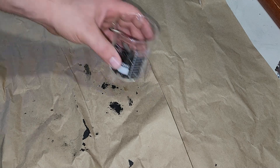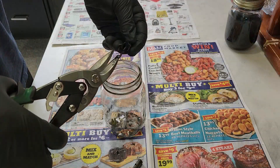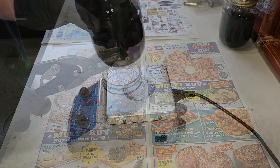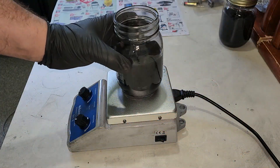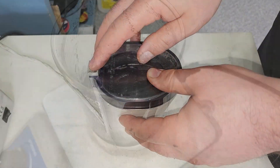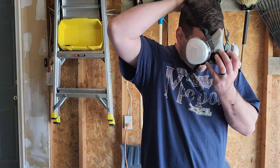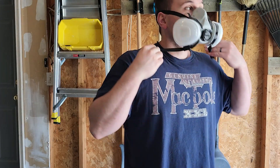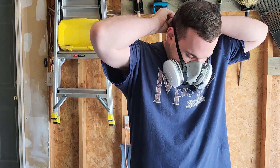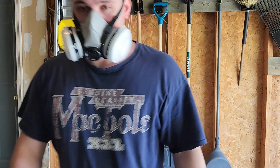It's worth mentioning the ABS juice I'm using is mixed at a ratio of 4 g ABS plastic to 10 ml acetone. The manganese dioxide powder was prepared by breaking down dead dry cell batteries, putting the black powder portion in water, stirring to break down the larger clumps, decanting the mixture after it had settled, and then grinding into powder when dry. A note about safety: because toluene and acetone are very volatile organic compounds, all this work was done while wearing a respirator equipped to handle organic fumes, and in a very well-ventilated area.